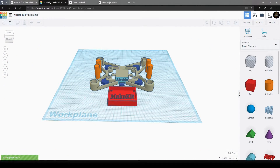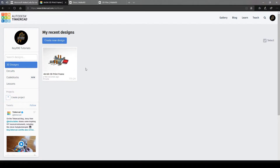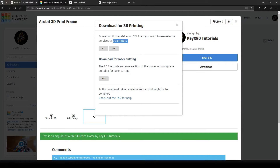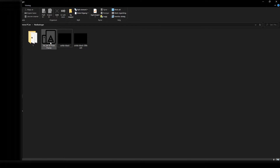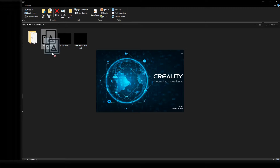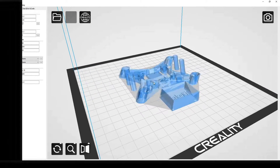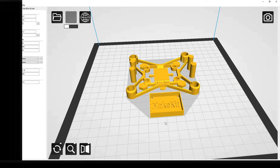Now, all you have to do is to go back to the home page on Tinkercad, then create a name for the project, go back, click on it, then download as a STL file for 3D printing, save and it will be downloaded to your download folder. Then open whatever program you are using for your 3D printer, drag the file into the program, let go of left click, make the adjustments you want and you are ready to 3D print the object.